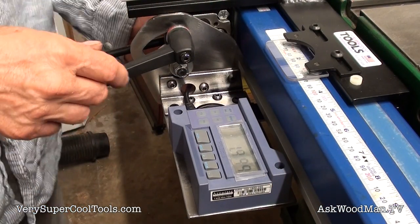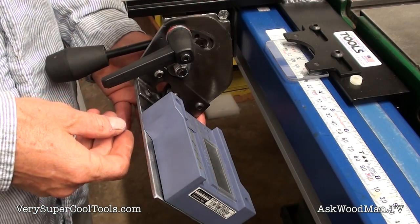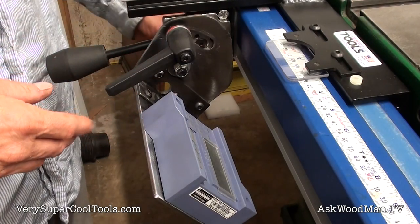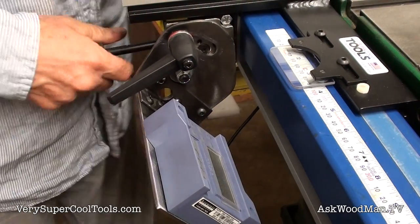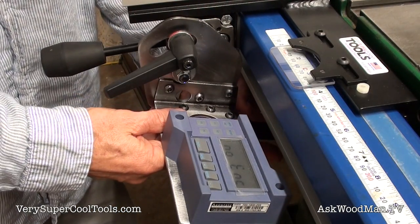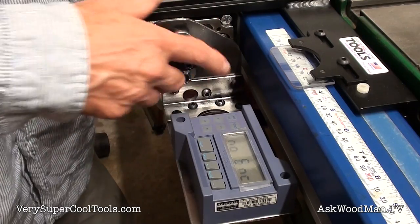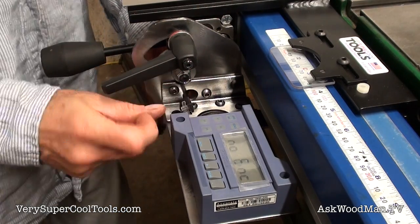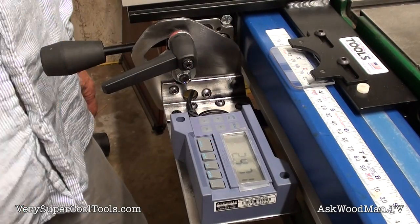Here's a close-up of my bracket that I made. All I have to do is just release this handle, and now you can see that the unit tips up out of the way. I just put a fairly snug tight on it, and I can release the encoder connection cord, and now I can lift this off. To reattach, all I have to do is reach up underneath here and find the little node on the encoder until it mates with the little tab on that plastic tab. Put a little tight on it, slip this back through, and plug that back in. Now the encoder comes back on and remembers exactly where it was.